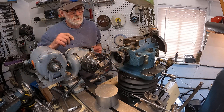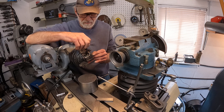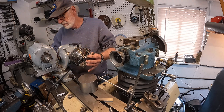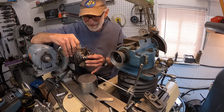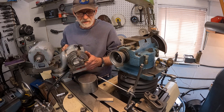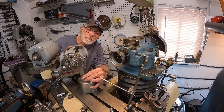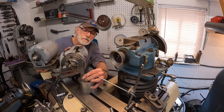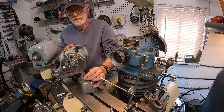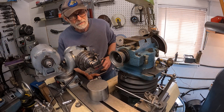So I'm going to put this in here. Don't get me wrong, you can do a good job hand sharpening these things, but it's going to take you a lot longer than it takes me to do this. I'm going to swing it around here and see where the angle is on this. Right now on this it's set at 10 degrees. I've ground this one before so it's close to being at 10 degrees, so I kind of reduced it a little bit.